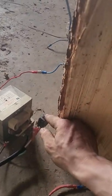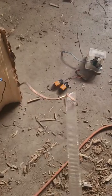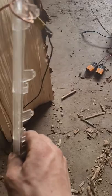Here we go — I'm going to turn it on. First I flip my switch, then I plug it into the outlet. Then I grab a safety stick, a non-conductive piece of material, put a piece of copper wire on it, and just touch the two electrodes to start the arc.